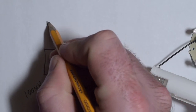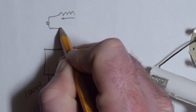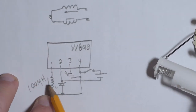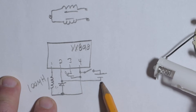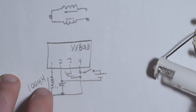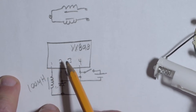So it kind of looks like this. And then there's your two connections. So it must use the same inductor to go one direction, then the other, one direction, then the other. So if you see here, I believe the small is the positive plate, not 100% sure, but it must go through this way and then back through the other way in order to work, because these LEDs here can only go in one polarity. So this must do the blocking in one direction.